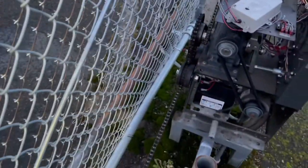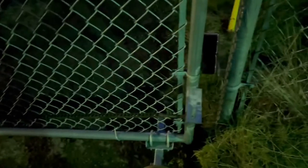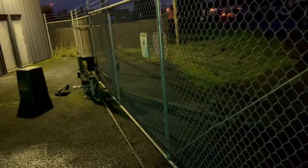Well, that doesn't sound good. The chain is still on there, so that's good, but I'm going to have to try something else because it's still not working properly. What I had to do was close the gate completely, take the chain off of the gate again so I could slide the gate all the way down manually, then bolt the chain back onto the gate. What was happening before is that the gate thought it was already closed and was trying to open it all the way, when in reality the gate was already open. This seemed to fix the problem.